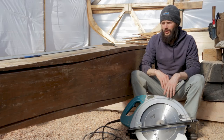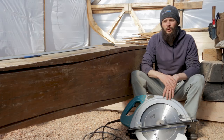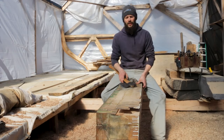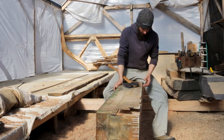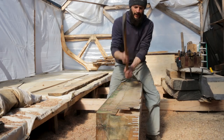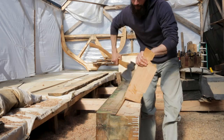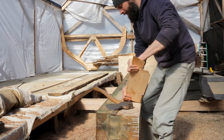I'll have Alex help me go through, we'll mark it, and then I'll grab the axe and do a little axe work. Since we roughly cut the keel timber shape and then cut it to final shape, the extra width is not the same all the way down — in some places it's really thin and in others it's upwards of an inch and a half thick. So I'm going to go down with the axe and just whack it. I'm not trying to cut all the way through; I'm just trying to cut enough of the fibers that I can haul this piece up, get some wedges in, and keep working down. Then once this is all split off, I can do the final shaping and remove it a lot more confidently.